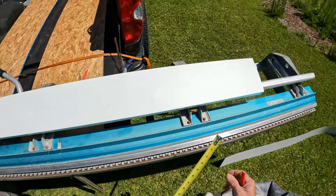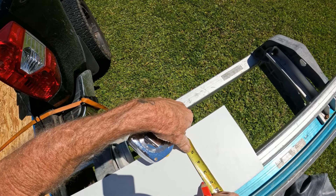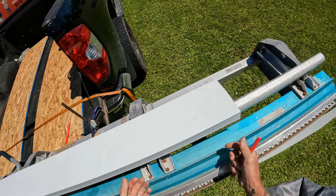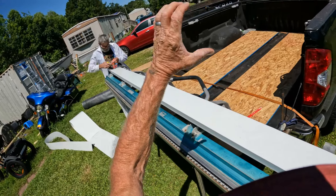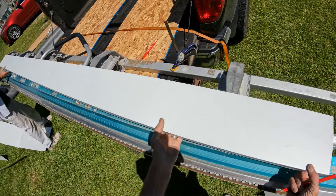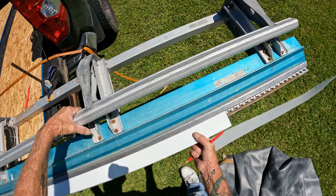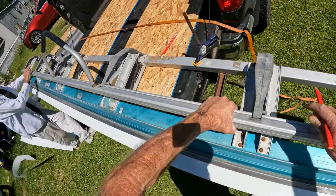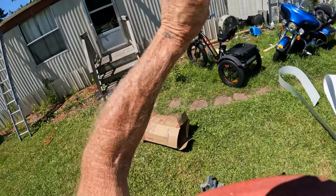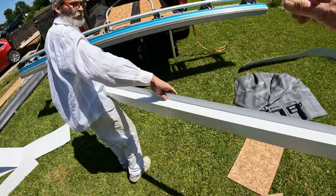Now we're doing the bottom boxing — we're marking the boxing right now, which is two and a quarter inches on this house. Then the face is just whatever's left, which is four and a half inches. I like to give it a bigger face than a smaller one, because there's going to be termination bar going above this, so that's going to take away some of it. If you give it a small three or three and a half inch face, you lose an inch and a half to two inches to the termination bar, so it makes the face look really small. We just like it to look a little bigger, like a normal house would be.